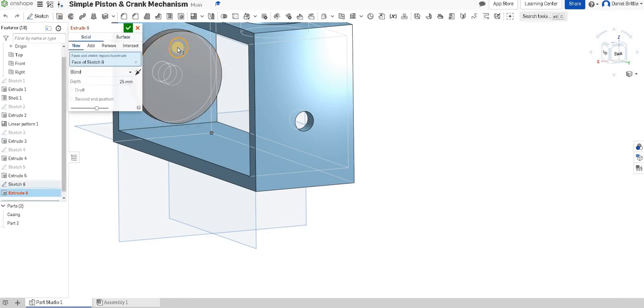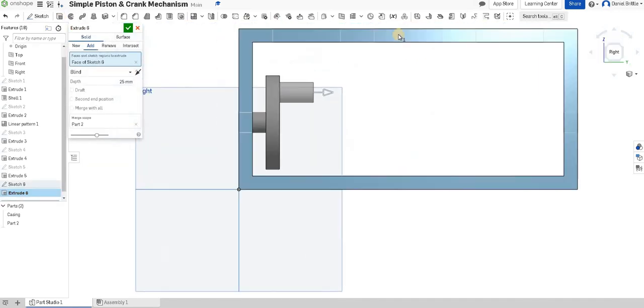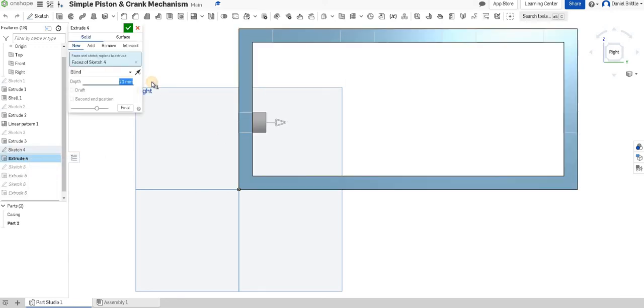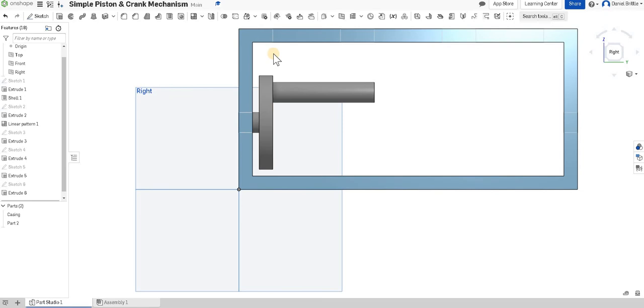So we're 15 from the edge and 40 from the center. We can position the others roughly in these corners — we won't worry too much about the geometry in this tutorial. We'll finish that sketch, rotate it around, extrude, and we want the center to come down and attach. Looking at it from the right, we try 75mm, which looks good, then adjust back to 15 millimeters so this edge and the part no longer overlap.